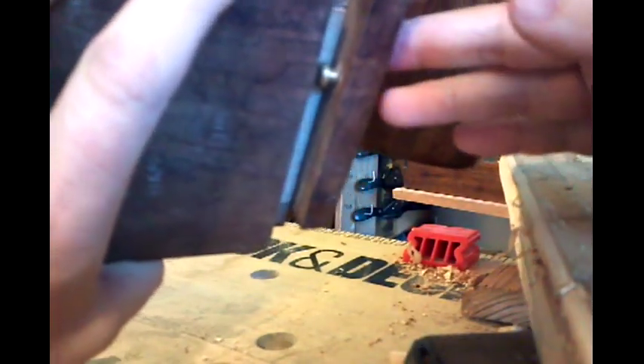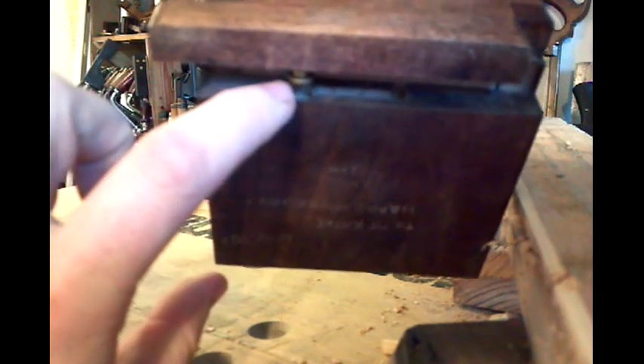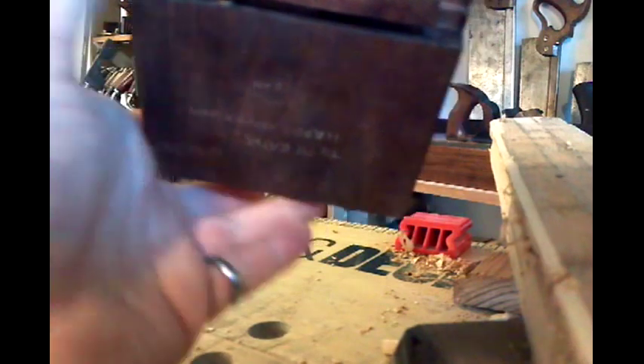On the back I've done the same exact thing on the back of the bottom that I did on the front — it's just a little bit longer. That back piece is holding the bottom, keeping it from sliding forward when it's locked in. You can see the pan head screw there — I drilled the hole the diameter of the pan head. And there's the slotted key that it slides into when pushed in. You just line it up, push it in, then it slides over inside the slotted key and now it can't move forward anymore — it's locked.